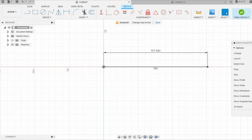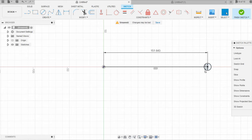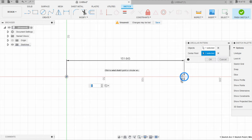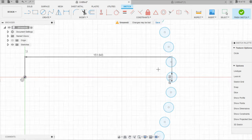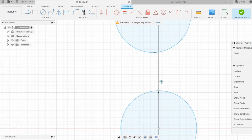Your roller diameter is supposed to be 10.16mm but I used 10.5mm because the printer isn't 100% accurate and you want a little bit of clearance. Then I just copy that circle 60 times in a circular pattern — that basically gives you the sprocket size. Then draw a three-point circle in between those just to find the center line. There's probably a better way of doing it but this is how I did it.